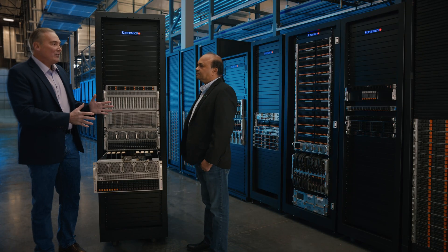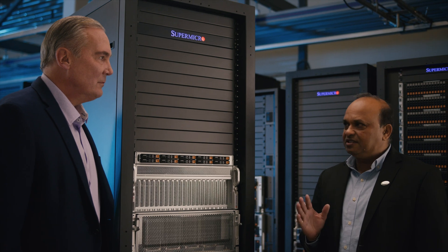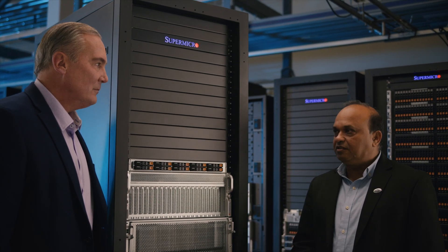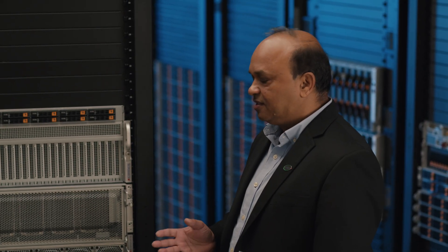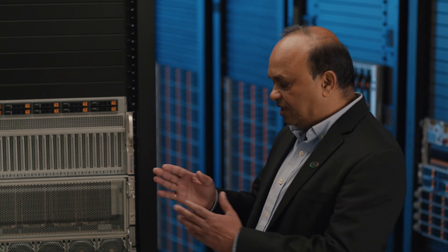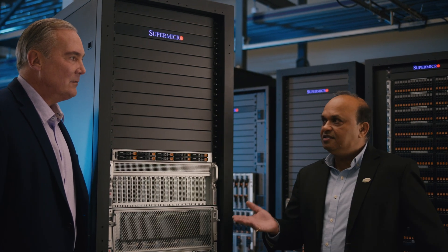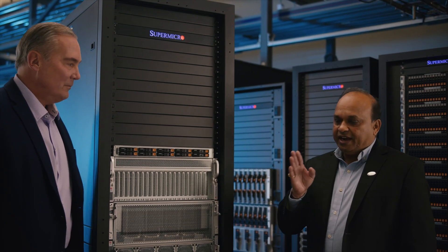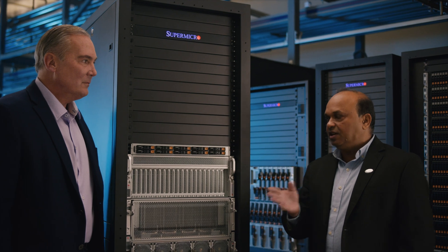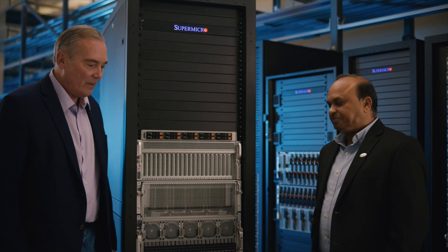This platform is also perfect for Omniverse. Omniverse and Metaverse are creating lots of buzz in the market, and at Supermicro we have this platform tailor-made for those applications. According to the reference design, there should be two root complexes, and on each root complex you can put four L40s. On each root complex you install one CX7, and there are two extra slots that can take care of other traffic.